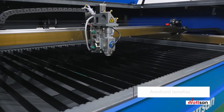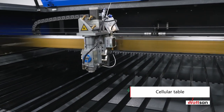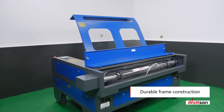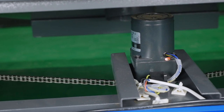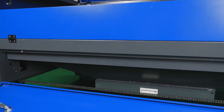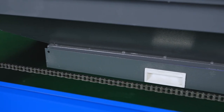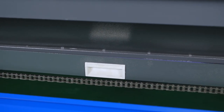The table comes with anodized lamella. You can also buy a honeycomb table for cutting fabrics or layouts with lots of small details. The durable frame construction increases the reliability and durability of the machine, with a metal thickness of 2.9 mm. A cone-shaped collection spike further strengthens the framework, nearly eliminating vibration and ensuring accuracy is maintained for a long time without further adjustment.